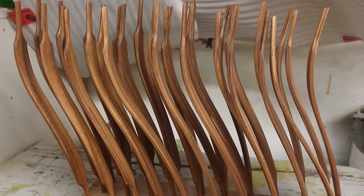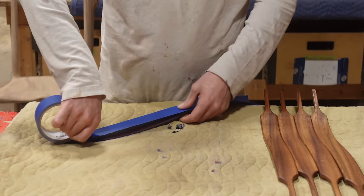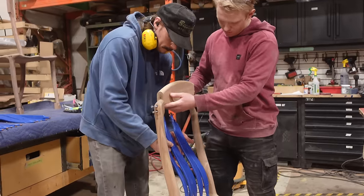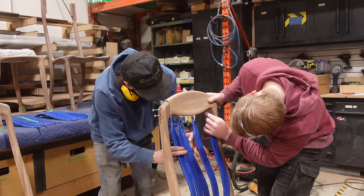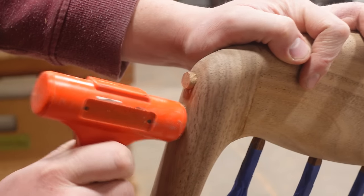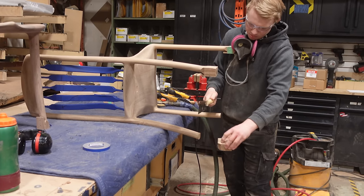Something fun — leave a comment below and guess the price we sold these chairs for, and whoever guesses right we'll send you something for free. Once we finished oiling the slats we cover them in painters tape to protect them while we finish the rest of the assembly. We carefully fit them into the seat, fit the headrest in place and apply the glue needed. The headrest gets screwed and glued into place with Monkey Pod plugs to clean up those holes. We also trim the large chunks left on the leg ends from where we were gripping during CNC machining, being careful to ensure all chair legs are the same length.